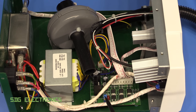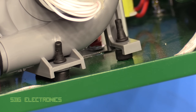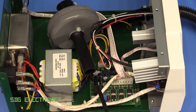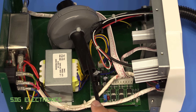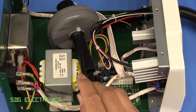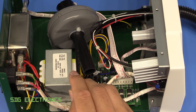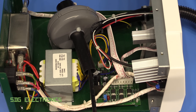We've got the brushless DC motor mounted on some anti-vibration mounts, with a tube that goes off to the front panel and off to the handle. This is the air inlet here with a rubber tube to try and attenuate some of the wind noise, because if you have it directly on the orifice of the blower motor you get quite a lot of wind noise from the way the air is chopped up, so this provides a bit of attenuation.